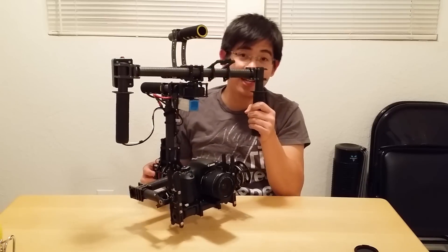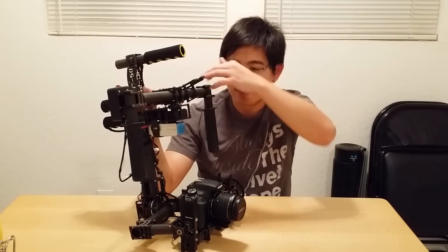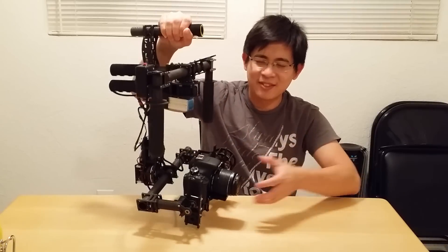When I saw it at NAB, I loved the technology and the idea, but unfortunately I'm not one of those guys who can afford to spend that type of money. So that's why I built my own — it's been a pretty fun process. This gimbal that you see here actually did not start out this way. I started with a very cheap gimbal thinking I could get it to work, but as the saying goes, when you go cheap you get what you pay for. The motors had a bad design — the way the gimbal was attached to the motor meant the motors took all of the weight, and when you're walking or running the whole thing starts to bounce and the footage is no longer smooth.